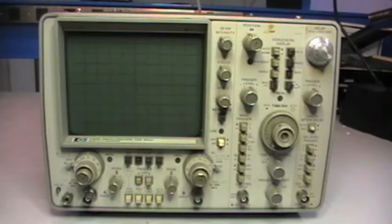However, I'm not quite sure when it was last switched on. So I will open the side covers, both up and down, and I will start with my variac, since I'm not quite sure how long ago it was last powered on, and hopefully we will see something alive. So let me do the setup and see what happens.